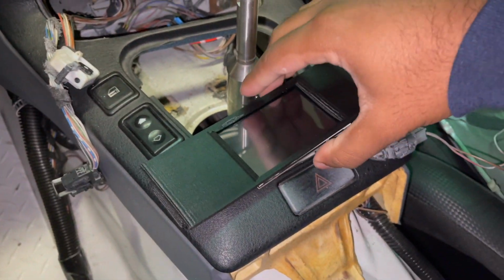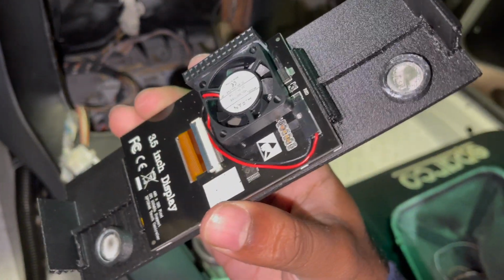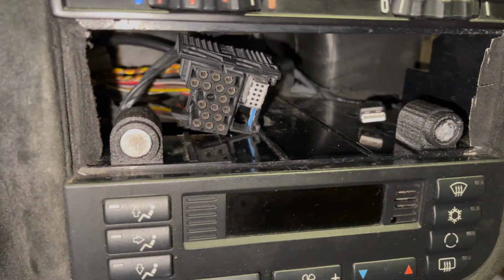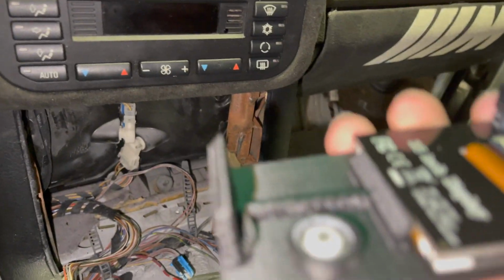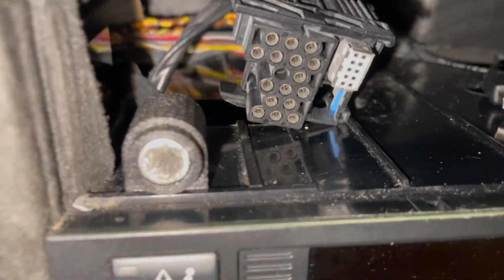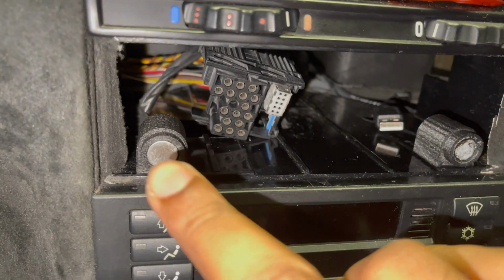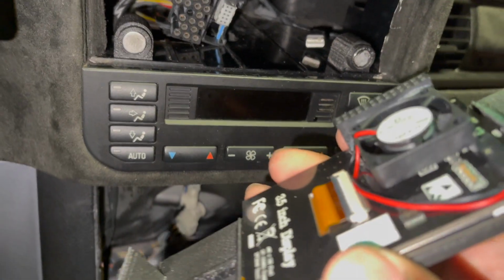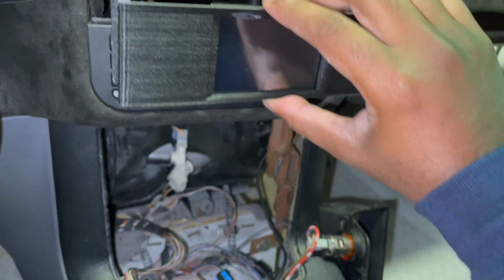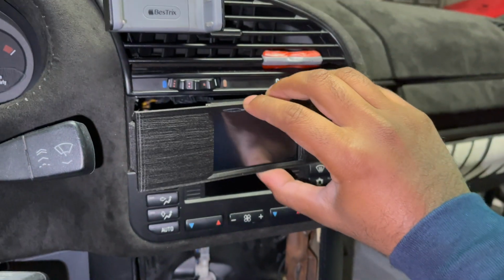All right, check it out. It's coming together. I've got magnets on this thing and magnets on there. And there's about a 1 millimeter gap between these super strong rare earth magnets. So there's about 2 millimeters of total gap between the magnets, and that's the only way to not have this be permanently stuck. So this is how it goes in.